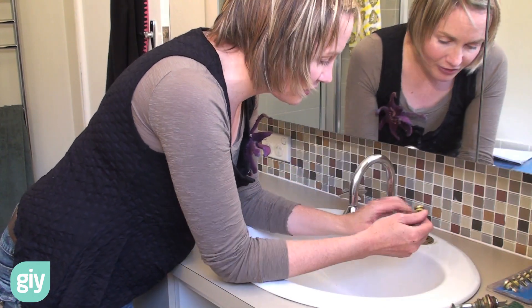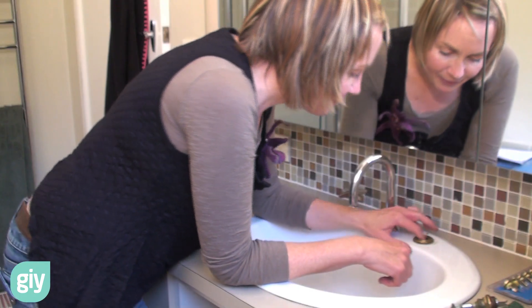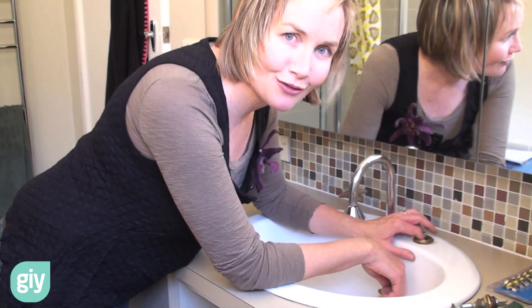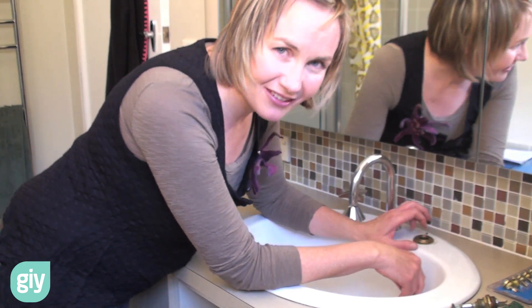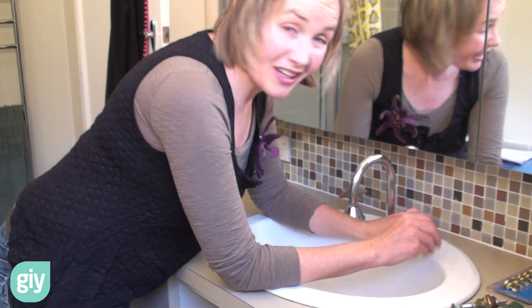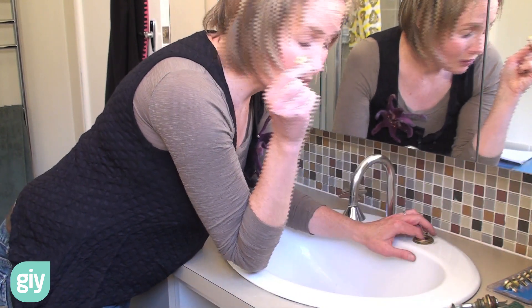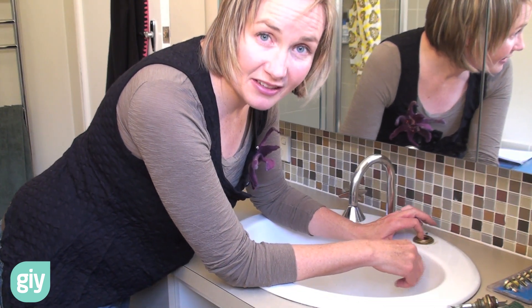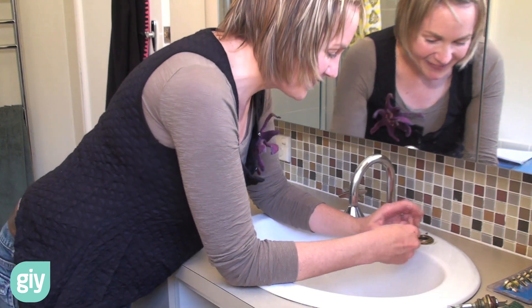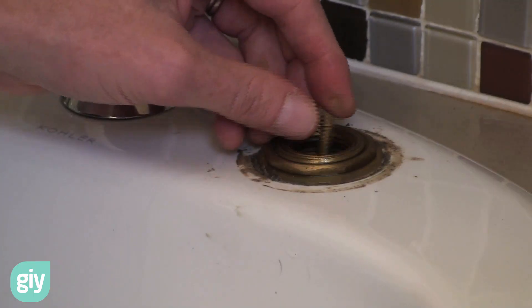So you just need your new washer to pop in there and start again. But before you put your new washer in, just check the tap seat — that's just underneath here in the tap. Have a little feel; it should feel nice and smooth. If it doesn't, if it feels like there are little ruts and jagged edges, that will be causing your tap to drip just as likely as a dodgy washer. You'll need another solution for that — watch the DIY video on how to reseat a tap. You'll know if that's the problem if when you've fixed it with your washer it still drips.